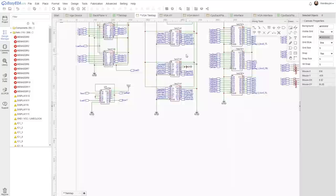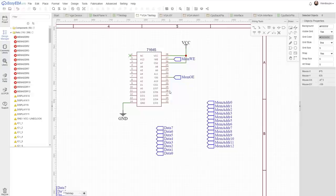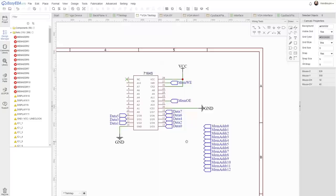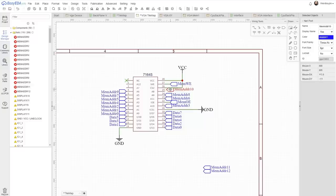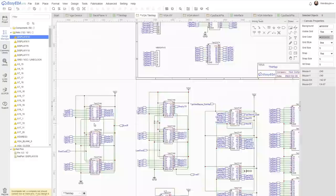Apart from we need all the rest of the lines on the memory chip. Okay, active high chip select goes up there. The active low chip select. Now I'm going to guess what works for the data lines. This probably looks fairly random at first glance, but I'm basically just taking the data lines in order from right to left. We don't actually use the top bits from these counters. The top two bits over here.